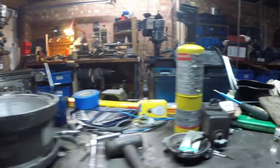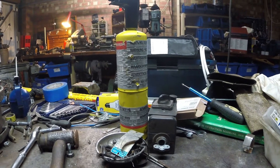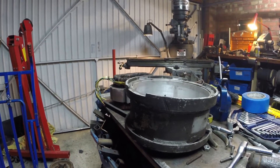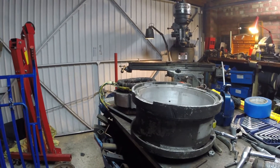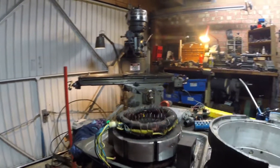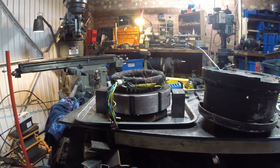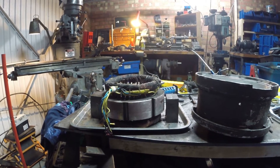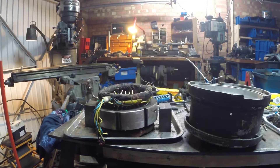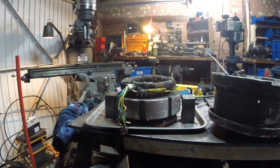It's got a little speed control which is the boxes here and you can swap it: reverse, speed two, speed one, neutral, forward, speed one, speed two. Now I initially thought that meant it was a star delta — if you don't understand that about three phase motors I'll put some links down below. Basically it's a different way of wiring the windings between the phases. So this has got what's called a Dahlander connection. It's got six coils and they're all wired star, but you can wire each arm of the star either series or parallel, which gives you two speeds and I think constant torque. I'll put a link down below, you can read all about that.